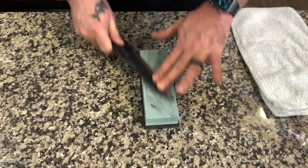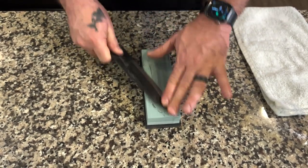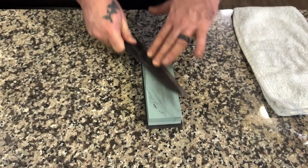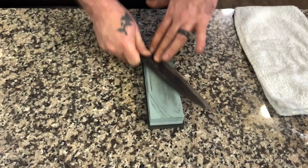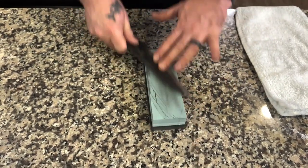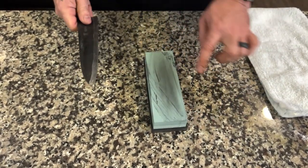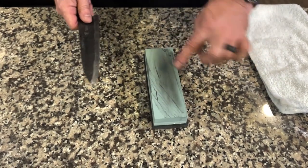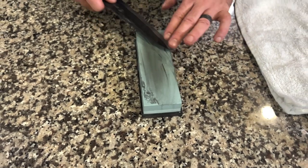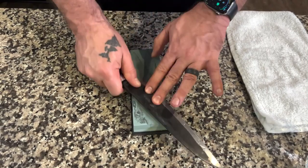As you can see there's material on top of the stone and it's moving freely. Please don't remove that material — the material is actually helping us to sharpen the knife. You'll see me trying to use all of the stone. If you have trouble getting into one corner, turn the stone around; that'll also help ensure that your stone wears evenly.